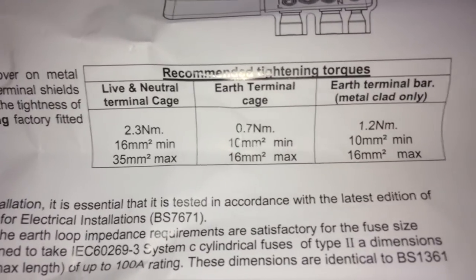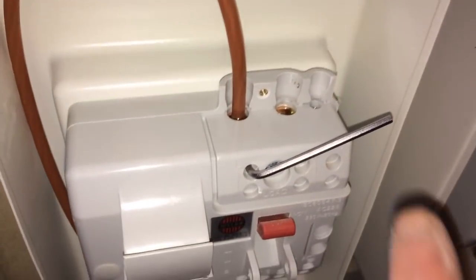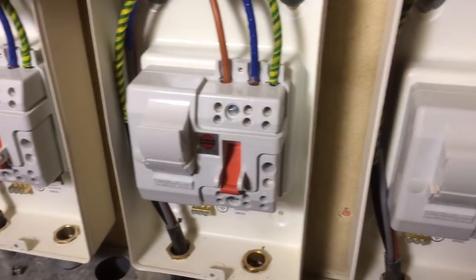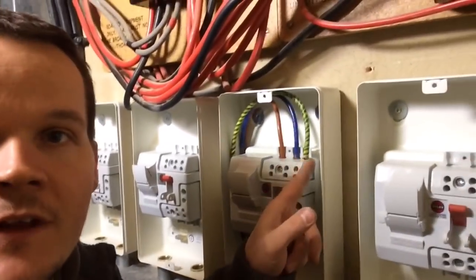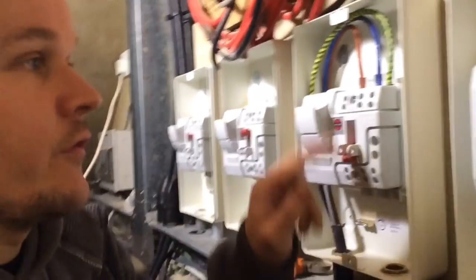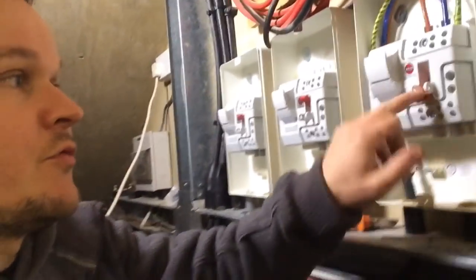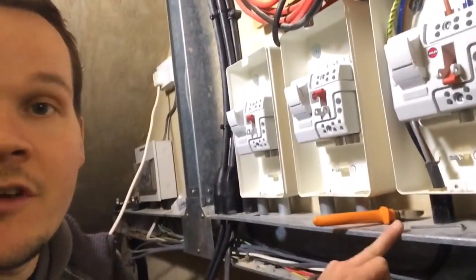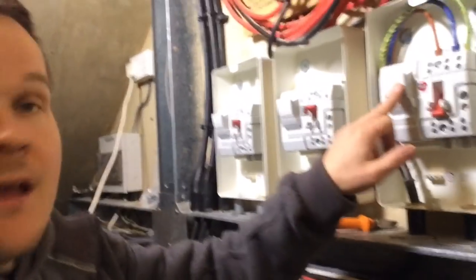For all the keyboard warriors out there — if you read the book that comes with the switch, you do get newton metre readings which you can torque these down to. I'm just nipping them up with an allen key, but I will get our torque screwdriver and torque all these up per the recommended manufacturer's specification. So if you can see, I've flagged up all my cables: live, neutral, and live, neutral, and earth. I did just test these through the switch — the only ones that isolate are the live and neutral, the earth is continuous all the way through. Sometimes you get a three-pole switch but not on this one. I've got a little earth terminal there which I will do some cross-bonding to the trunking — it's good practice just to link them all together. That's the end of the video today — if you liked it give it a thumbs up, and I'll see you on the next one. Take care.